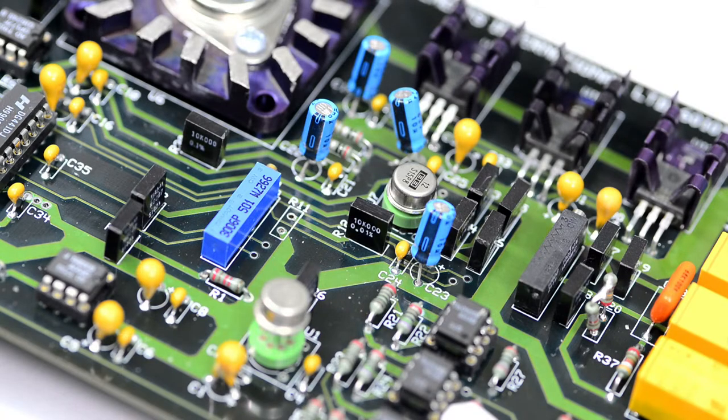And I don't think I'm really qualified enough to first understand everything that works in this bridge, and second to call anything an improvement without that deep understanding. So I think we will just do fine in here with discrete resistors. After all, it doesn't really matter what currents these sources are providing, as soon as they are stable within the measurement time, and as soon as the magnetic comparator is working correctly.